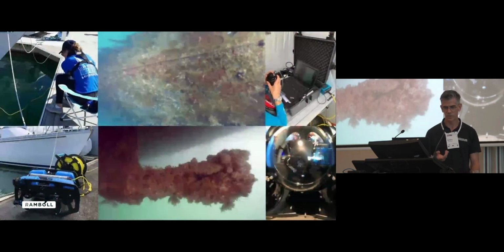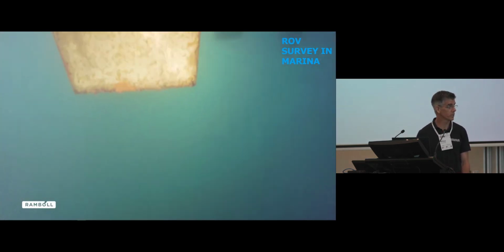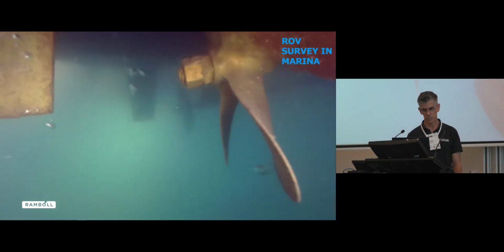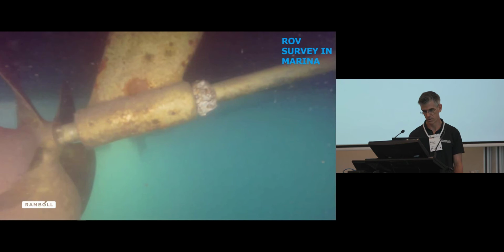And we were also, again, using the blue ROV. It was quite easy to use, but we were also seeing some fairly heavily fouled vessels as well. You can see the nice folding propeller on the center bottom there. That's not turned for a while, and I think there'd be some serious problems if they tried to turn it now. And likewise, a little bit of video from the ROV glider. This particular boat was actually a level of fouling 5. It was pretty clean in the stern towards this area, but as you moved more towards the forward ends, it was pretty messy overall.